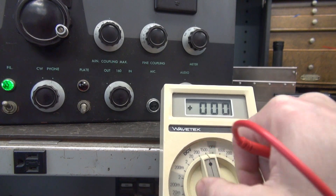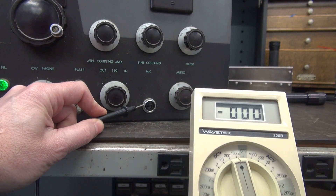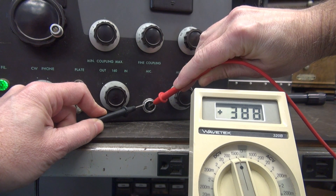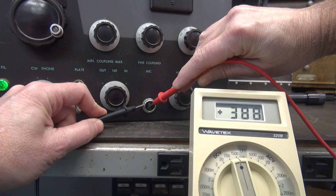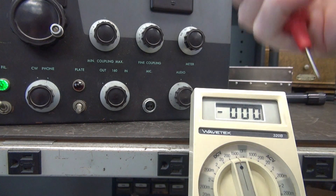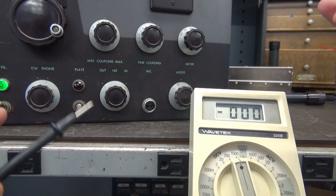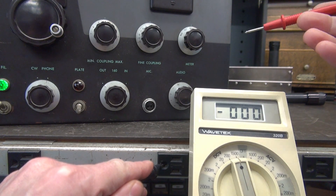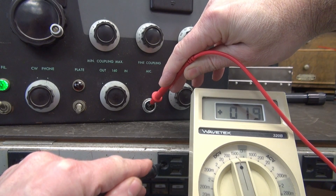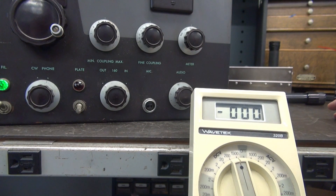Now let's go over to DC and take a look at the voltage on that mic jack. Here is the switch side of the mic jack — this actually pulls in that relay I showed you underneath. There's 388 volts on that pin, and that goes to your microphone. So imagine this: you didn't ground your transmitter, you plugged in your D104 microphone which has a metal case, and now you accidentally touch ground with this hand. You're resting your hand on some other radio that's grounded, and this voltage is coming through the microphone. You can see the DC bled down, but that potential is there — 388 volts ready to go through your heart.